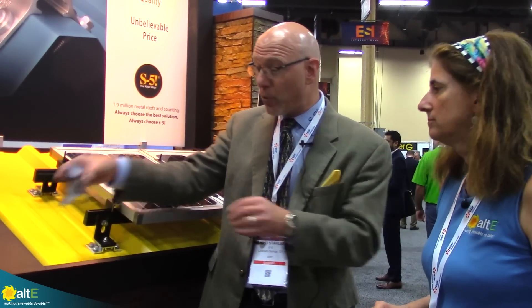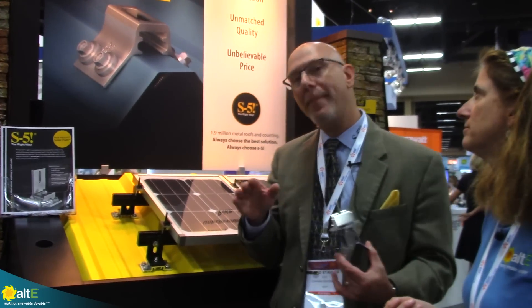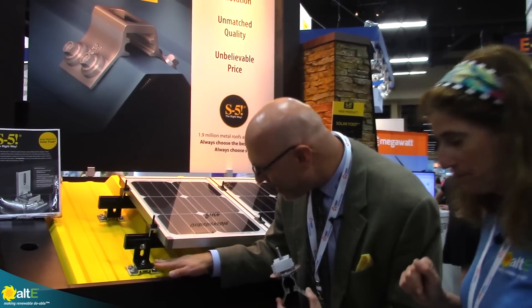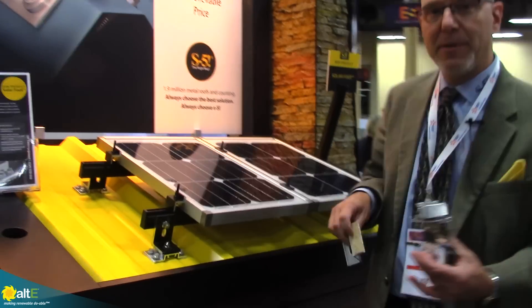The cleanest way to handle exposed fastened roofs is to use a PV kit on top of one of our brackets — this is the rib bracket, and it comes in four different sizes, varying from panel to panel. Rib bracket 3 is most commonly found in the United States. However, there are times when a contractor may choose not to use a PV kit; we prefer it because it's the most economical option.